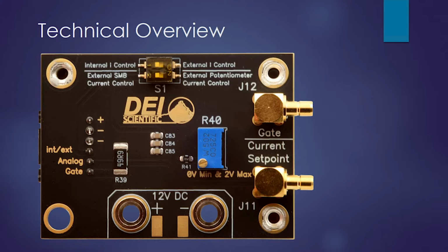On the top is S1. It's two dip switches that are used to control who is controlling the output current. You can use the internal pot, or you can use the pot on this board, R40, or you can use the analog signal on J11.